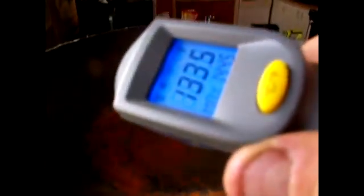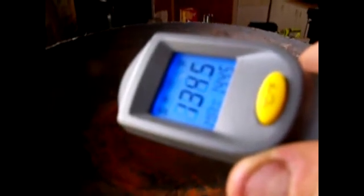Water soaks heat really well. See how it's done with the temperature of the heat — the water is soaking the heat and it's turning into vapor. That should actually be the hottest part of the fire, but it's not because the water is absorbing the heat. It's a pretty stable temperature even though the other temperature is rising. At full temperature, this single-wall pipe will stay about 70 degrees.